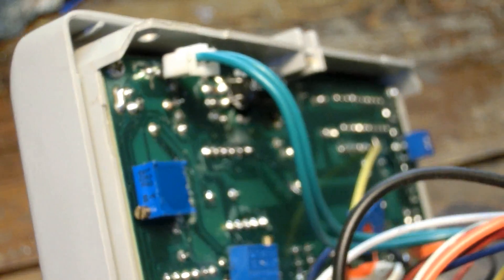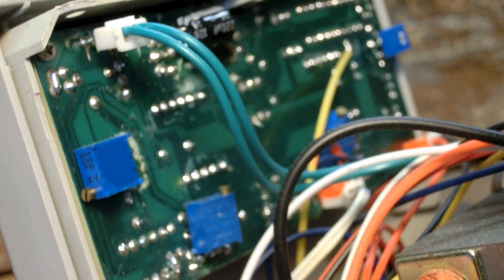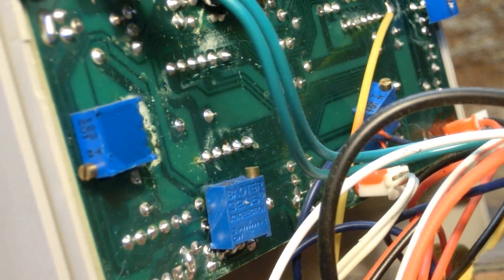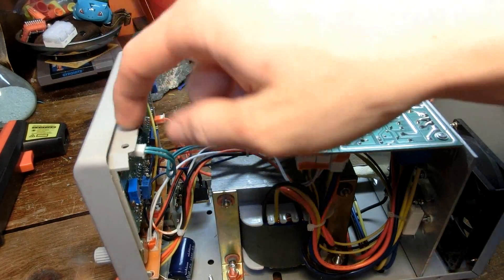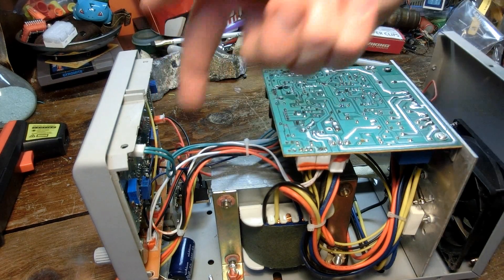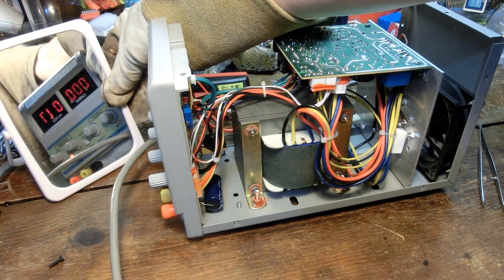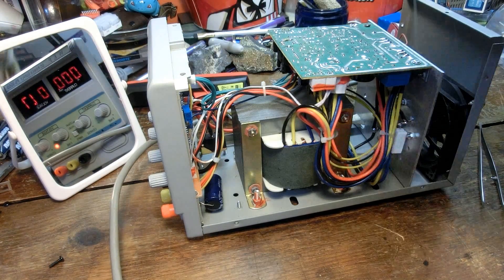There we have the main board with the LED displays on the side. Those variable potentiometers are kind of all over the place — that one in the middle is not really on the board. The front meter on this thing has always been about 0.2 of a volt off, and I think I could fix that by adjusting these potentiometers. I've just been too lazy because 0.2 of a volt is not really that big of a deal. We can see the numbers, even though it's kind of reversed.